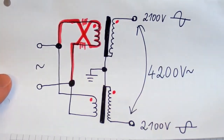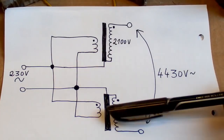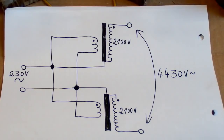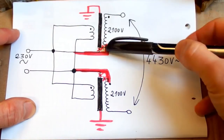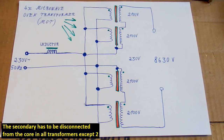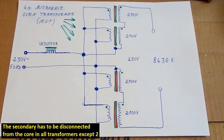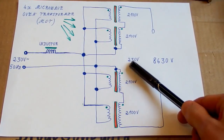It's also possible to put the mains voltage in series with the secondaries to get a little extra voltage, instead of grounding the secondaries — this is what I usually do. The disadvantage is that one core becomes live and one neutral, meaning there's 230 volts between the cores, so you can't put them on a common metal surface. If you want to put more than two microwave oven transformers in series, you have to disconnect the lower end of the secondary from the core in those units. This is my power supply with four microwave oven transformers, with all secondaries in series and the mains voltage added — theoretically giving 8630 volts.